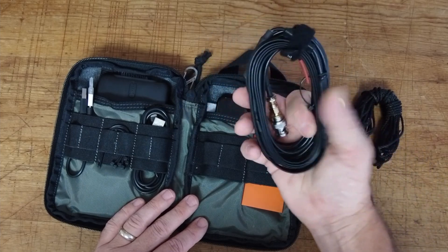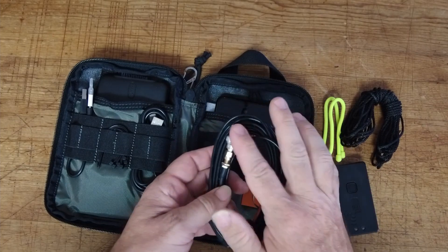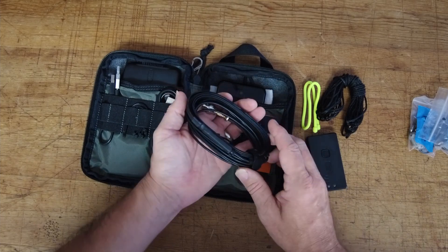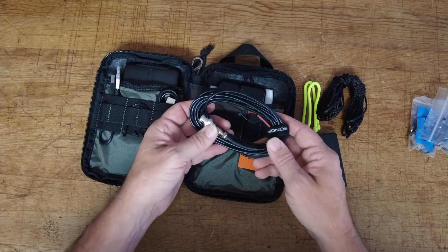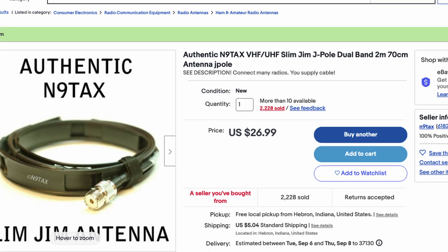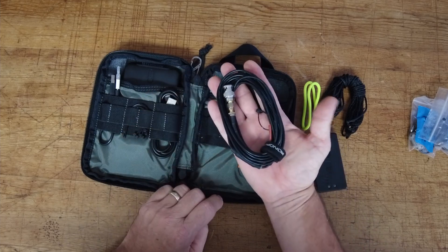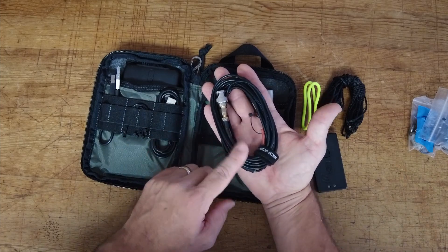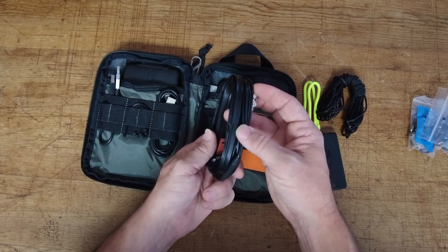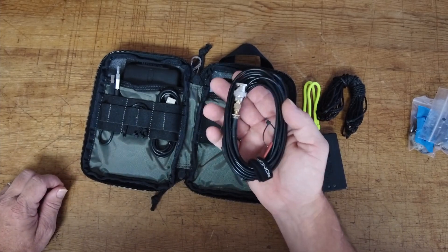Above that, you'll find a roll-up J-POL style antenna. I've put a BNC adapter on this one since I've moved all of my HTs over to the BNC-style connector. I purchased this several years ago off eBay from a gentleman — I believe his screen name was Nelson Antennas — but I've gone back and can't find this antenna anymore. There is another guy, I believe his call is November 9 Tango Alpha X-Ray, who makes a fantastic roll-up J-POL as well. The thing I liked about this one was its compact size when fully rolled up. The downside is it's only rated at about 10 or 15 watts — it uses very small twin lead, and if you run 50 watts through it for very long, you will melt the antenna.